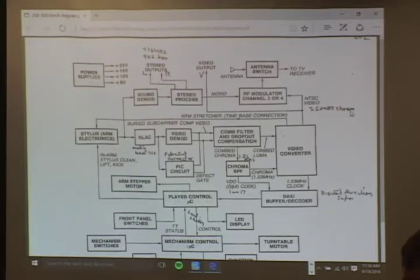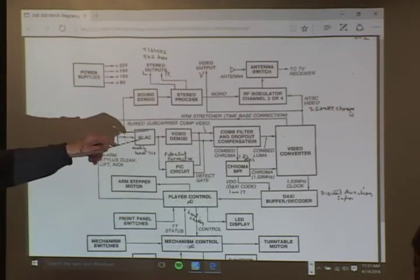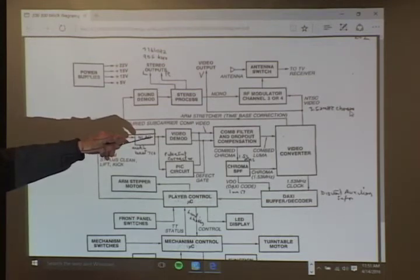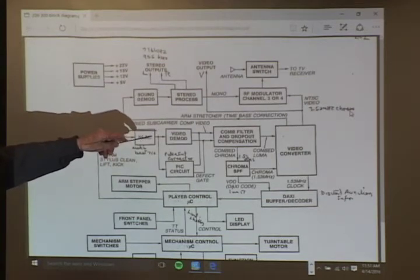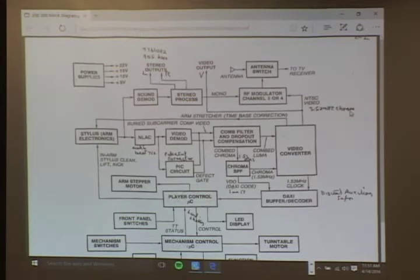They are not expensive and they're fairly easy to change. They're 16-pin ICs. If you do put them in, we certainly recommend that you use IC bases, because it's not at all difficult to screw up the copper on the printed circuit boards. Occasionally, if the picture's not there, the video demod chip, which is very similar to the audio one, should be replaced as well. For those who have the service manual, it tells you what to check when you've done it. There's a frequency that you need to set.